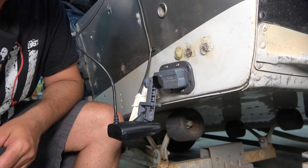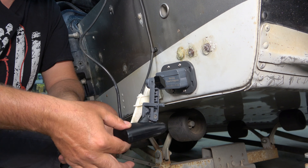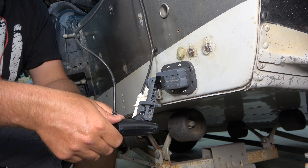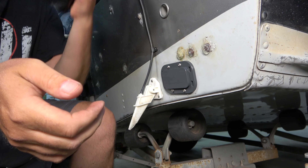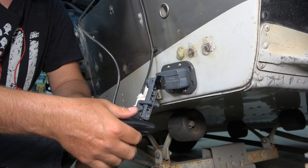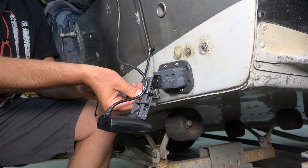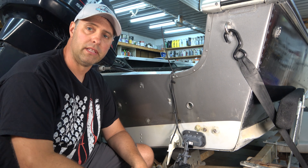Now I just have to make sure the transducer is facing the right way. It's a little bit loose so I'm going to tighten it up more. Once it gets in the water I'll see how the boat sits and make some adjustments on the water. Cinching it as tight as I can get it — that should hold it. To take it off you just turn it sideways and pull it off, so even when you're trailering you can just take it off and throw it in the back of the boat so rocks or debris won't hit it. To finish up, I'll put some zip ties around the cord to keep it from flopping around in the water and trim it up nice.